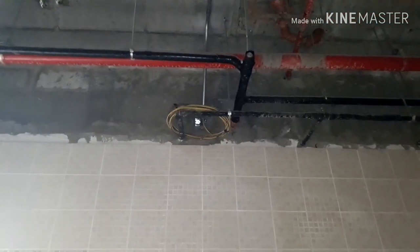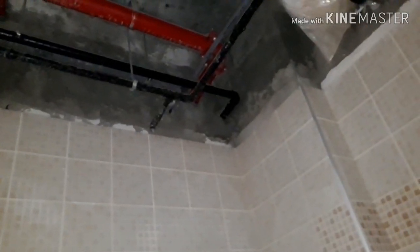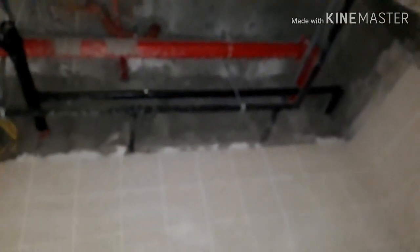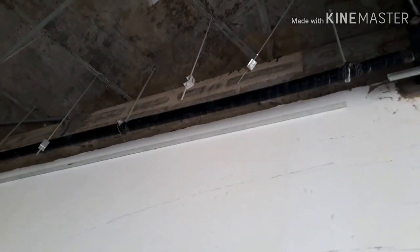You can see it is concealed. On the right-hand side we have one more branch line, 25 mm — we will see this one also. Prior to going for rubber tube insulation, you have to make sure to perform the water test and leakage test.